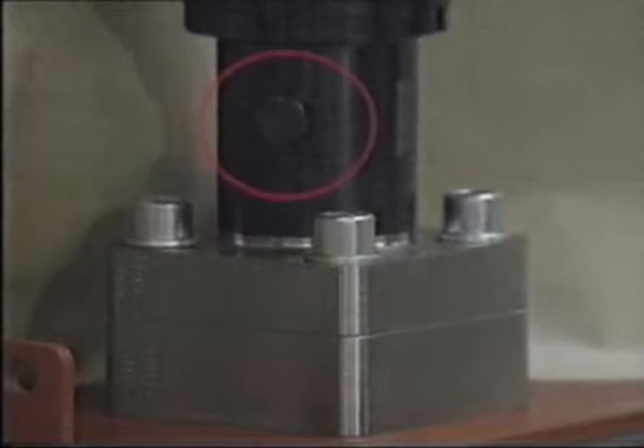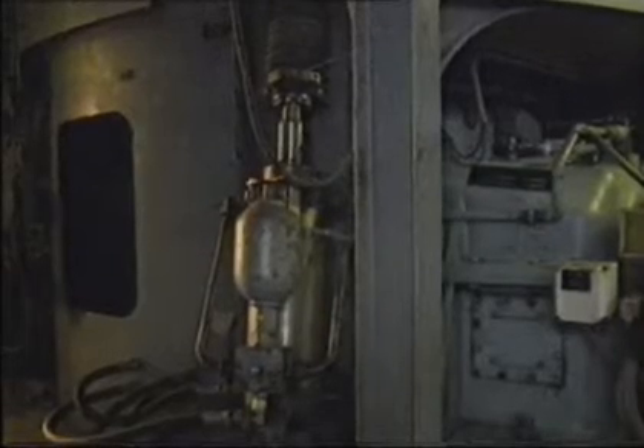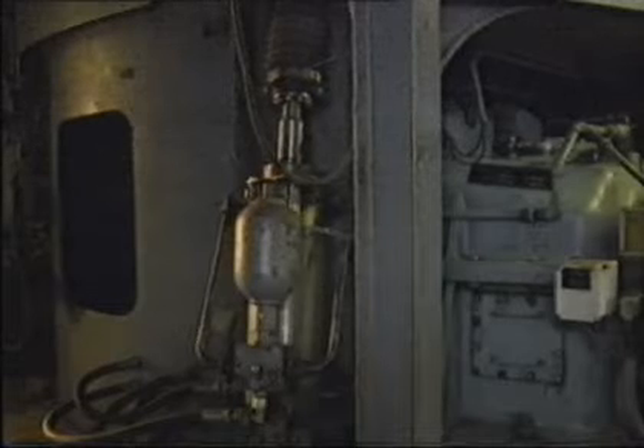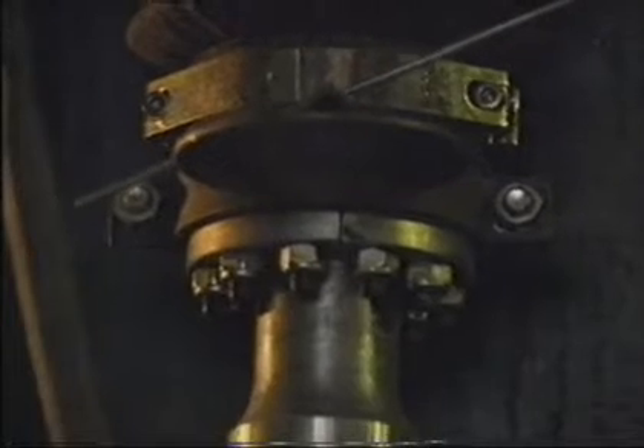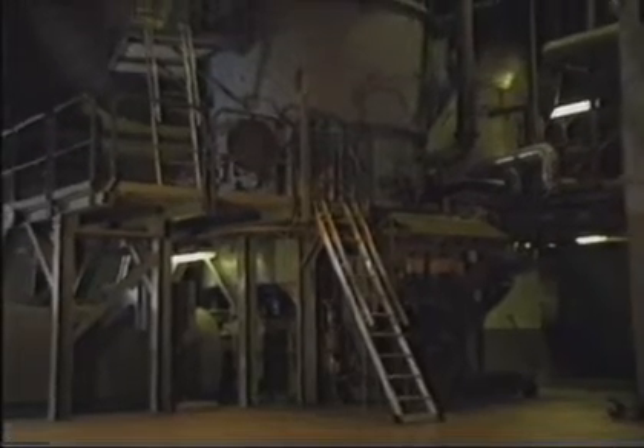Special air removal nipples can be found on the side of the accumulators. If a part of the system near the cylinder has been removed, it is necessary to move the cylinders to their extreme position to expel the air. This can only be done by removing the pressure rods from the cylinders. It is important to check that the pre-charge pressure has the correct relationship to the grinding pressure. The relationship between these two pressures at different levels are given as a graph in the operating instructions available with a specific mill. For every grinding pressure, there is an optimum pre-charge pressure which gives the vertical mill the best possible grinding effect without damaging the gas membrane.